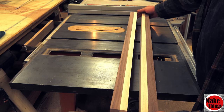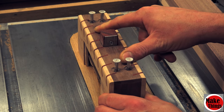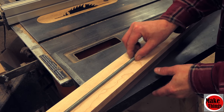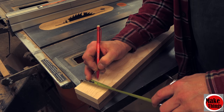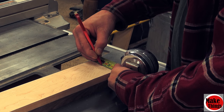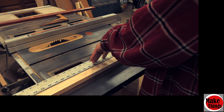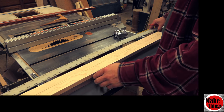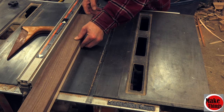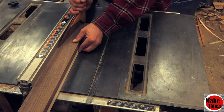Now that both sides of the jig are ready, I raise my blade three-quarters of an inch. With the jig half that will sit against the fence, we'll want to cut a channel that's the width of a 5/16th inch threaded rod. I found the center and drew a line to give a better visual. I passed it through the blade the first time with the blade being centered as I could make it, flipping it around and passing it through the other side. This makes cutting the center out easy.